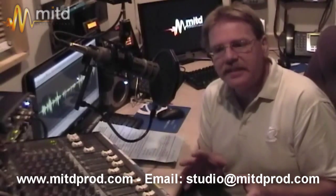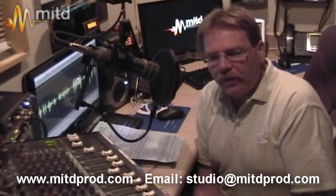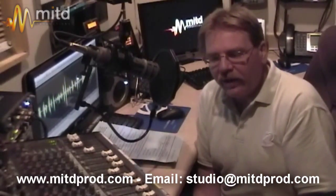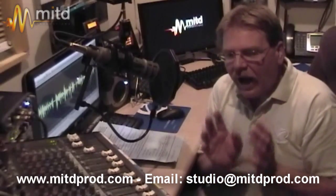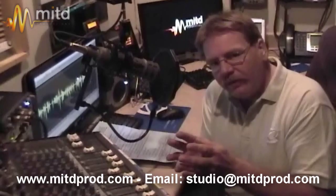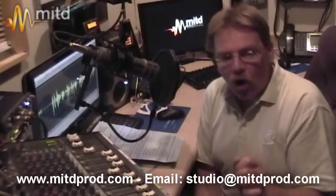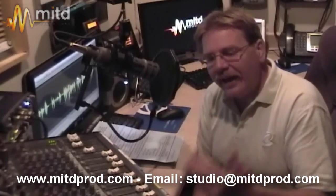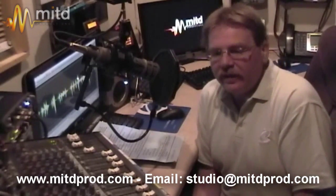For this, we use what we call an aux minus setup, performed by the mixer board. You can see these knobs here are the aux output controls — the aux output is what I feed to the phone patch. On each channel of the mixer board, I'm sending a volume level from that fader — my PC, my microphone, anything else — down the auxiliary feed to the phone patch. Aux minus means the fader that the phone patch is on has the auxiliary output turned all the way down or off. So I'm transmitting all the audio over the phone line except the telephone receive audio — that's called an aux minus: auxiliary output minus the telephone input fader.